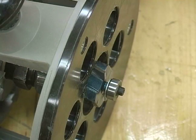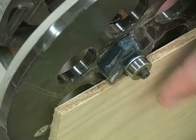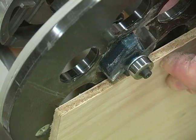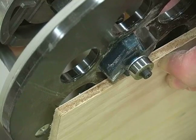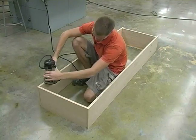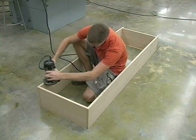The tools I am going to be using is a router with a 3/8 inch by 1/2 inch rabbeting bit. I have set the depth of my router to the thickness of my quarter inch sheet of plywood. Next I am just going to go around each side of my project creating that rabbet.